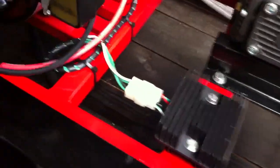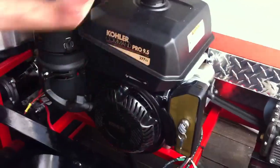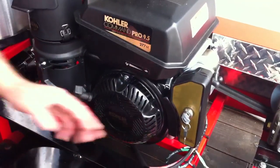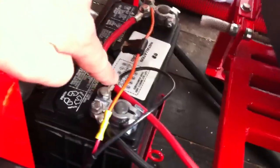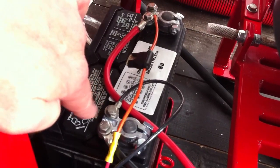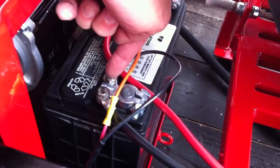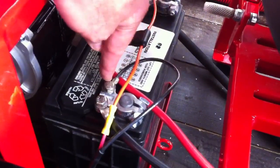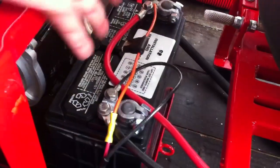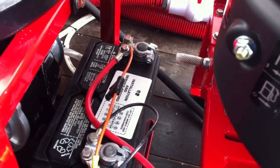This is on a Kohler — a brand-new Kohler engine with a 20-amp rated charging system, actually 18 amps to be exact. We're feeding that to a large battery. This is a Group 51 capable of big cranking amps like the battery in your car. It's got all the standard hardware removed from these battery terminals and upgraded to stainless steel, with beefy crimp connections, properly fused connections, and fuse holders facing down so rain won't get caught in it.